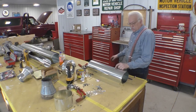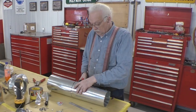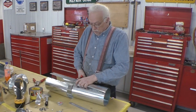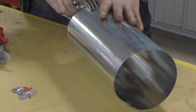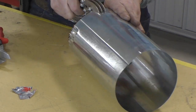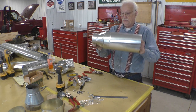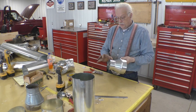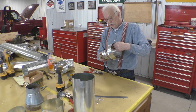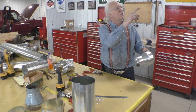Let's go to the workbench. The first step is to make a short length of pipe that turns out to be exactly one foot long. So now we have a six-inch male, which fits nicely into a six-inch female — it's nice and tight. What we need to make now is the four-inch male-male connector so that we can go from this to that four-inch flexible rubber hose. You've just seen me make this, so there's no sense watching me make that — I'll bring you back when we're ready to hang it.